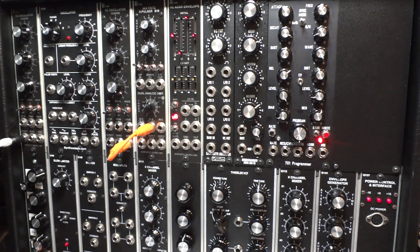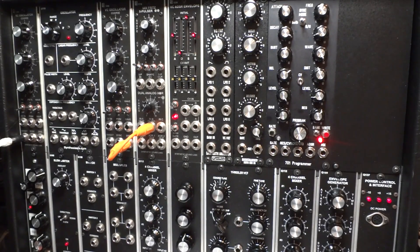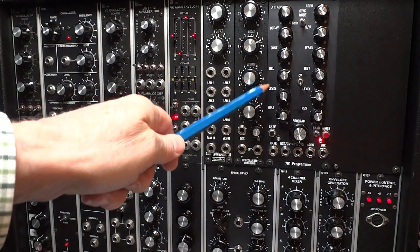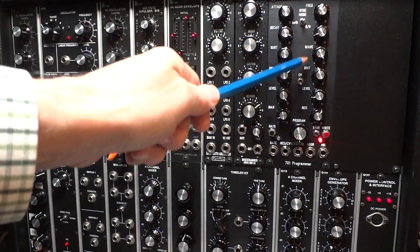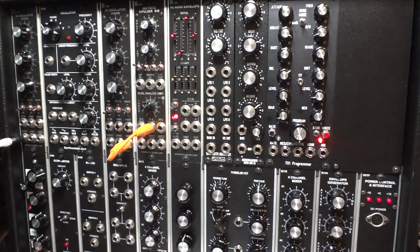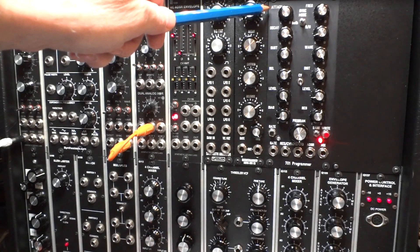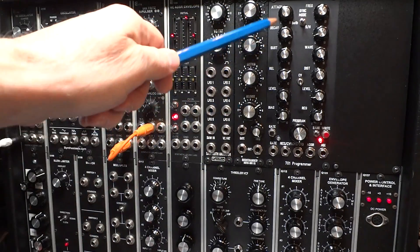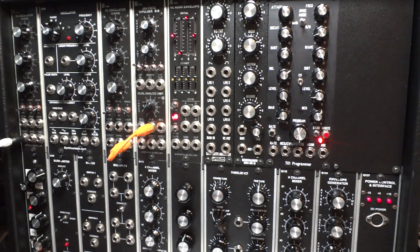We also have the Cynthia sawtooth animator, the SSL InFritz Five Pulsar, and dual analog exclusive-or, which is being used for the ring modulator. The only other item in here is the 701 programmer, which is designed after the Sequential Circuits Model 700 programmer. It includes an envelope with level, a bias for adjusting the cutoff frequency, and an Electric Druid LFO, as well as four control voltage outputs — one for resonance and three others routed to tuning for VCO3, the level for this envelope generator, and the voltage controlled fat level for the sawtooth animator.